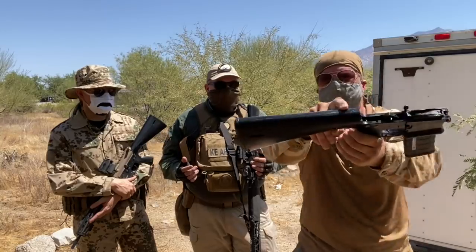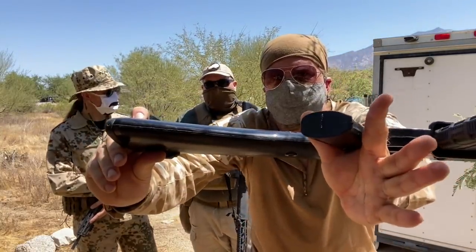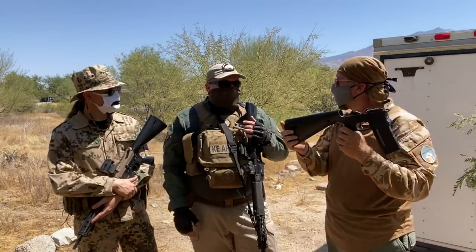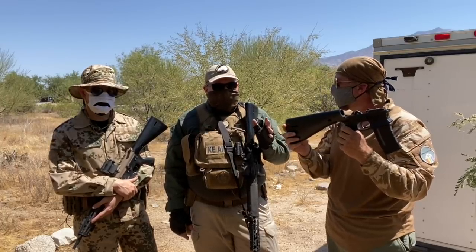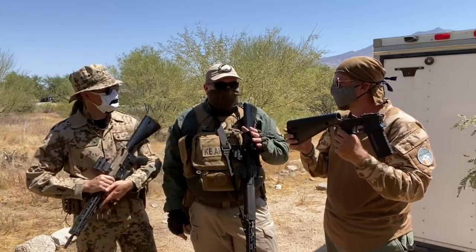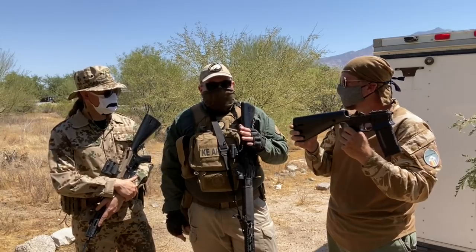So this would be the welder here. That's what I'm showing you. Right. So every contact surface between the two halves gets vibrated back and forth at a high frequency, melts and fuses together. That's so cool. So serial numbers 1 through 20 were one type of material we were testing out of the mold, and serial numbers 21 through 50 were the material that we chose to go with for production.